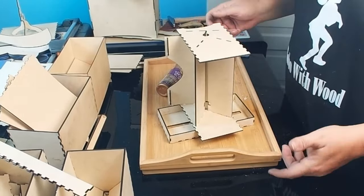But as you spin this hopper, you see the little cams on there, they'll rotate through those open slots, and they protrude up through the top where the pencils will be sitting. And what that does is agitate the pencils, because what I've discovered, when you're working with those hexagonal number two pencils, they could actually get side by side here and then not want to fall through the hole. They'll be too wide to fit through, and they kind of lock themselves in. So by putting these cams on there, that pushes them up, upsets them, and then they fall through the slot. It rotates around that slot, agitating them for the next one, fills that one, so it's always got one in the slot ready for distribution.